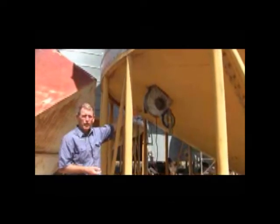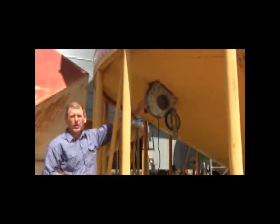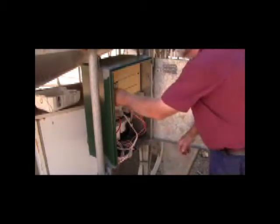Fan size — about a half horsepower or 0.4 of a kilowatt. For the design, we're trying to get about 2 to 3 litres of air per second per tonne. So in this case we've got a 100 tonne capacity silo, and for this fan we're looking for around about 200 to 300 litres of air per second. This will give us the air change rates we need.